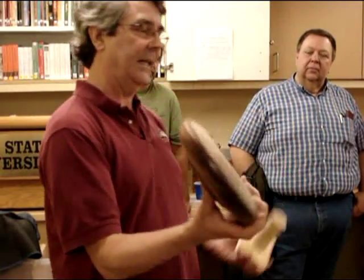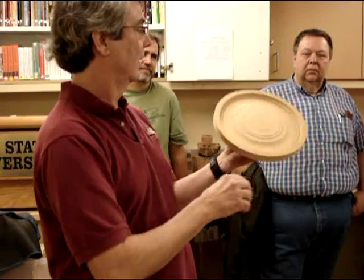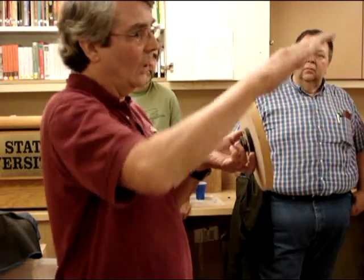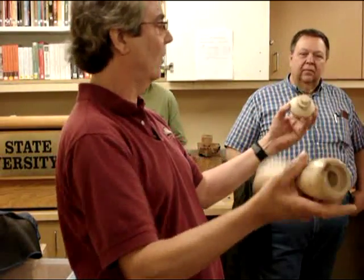This is for my Ikebanas — I have the hole for the little Kenzan that goes in there. I can stick it on there and finish all the way around in one pass without two setups. Once again it goes on the lazy Susan. This is similar to what Chris had but I used MDF instead — just a jam chuck for reverse-turning my balls. And this is a little jig for doing your pepper mills after you've drilled your hole.